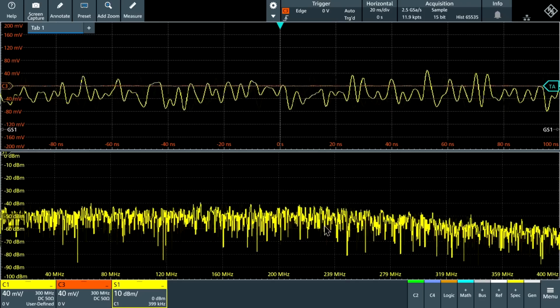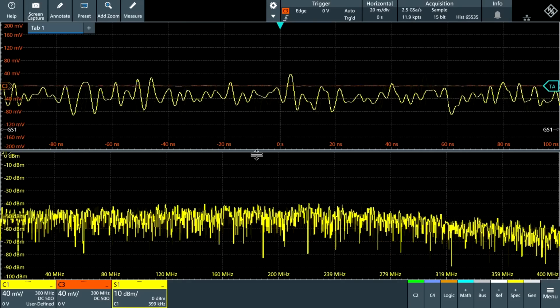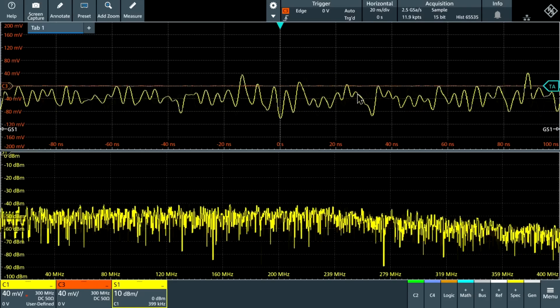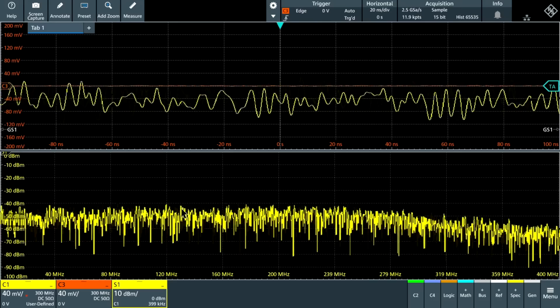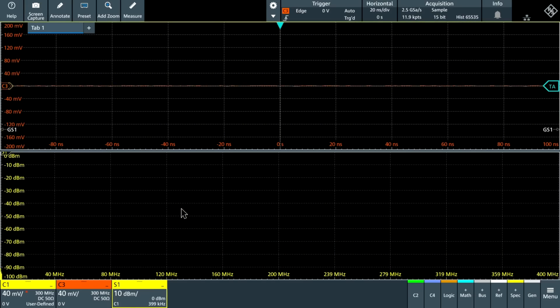And the probe does indeed have more than 250 megahertz of bandwidth, but we will measure the bandwidth of the probe separately. Now you have to wait for the probe to warm up about 10 minutes before you calibrate it, so you get a little bit of drift until everything stabilizes. And that way you get the correct DC gain as well as, of course, the AC gain. So this additional noise that you see is inevitable. That's the consequence of the probe being turned on and being active. Again, this is not a problem, it's just the reality of using these kinds of active probes.